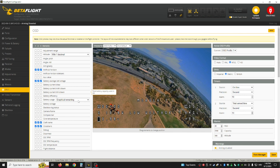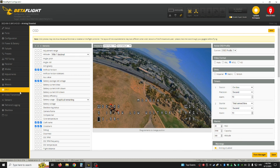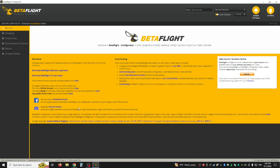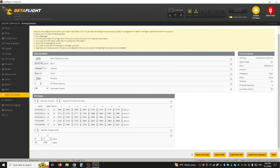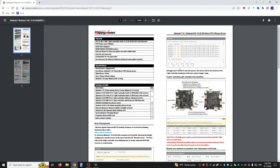In the OSD you can add whatever you want to your goggles. I didn't configure this so you're just running the default, but I'll show you how you would configure it. You just have to go into Ports and set UART 2 to VTX TBS Smart Audio, save and reboot. Then go into Video Transmitter — if you don't have Video Transmitter shown, enable Expert Mode, and then it will set everything for you. I'll link the manual in the description.